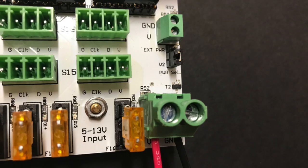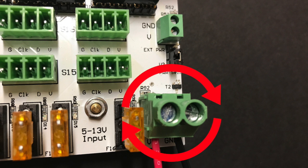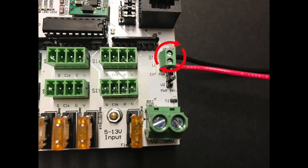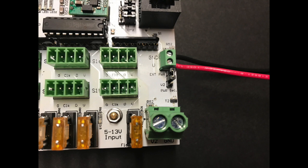There are two options for powering the controller itself. As shipped, the input jumpers are configured for 12 volts and power is derived from the V2 power connector. If you plan to use 5 volt pixels on ports 9 through 16, connect an independent power supply to the external power connector and set the jumper to external. If you have 12 volts on V2, make sure the jumper is set to V2. It's possible to damage your board if the jumpers are set incorrectly.